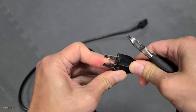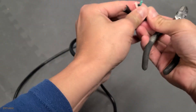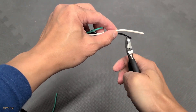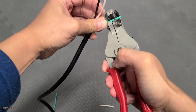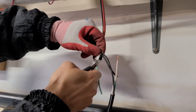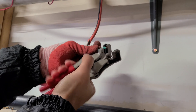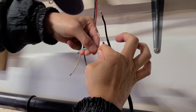Going back to the repair — because it's burned it doesn't smell good, so I'm going to cut it off. Next, we are going to get to the wires inside. This part is very important: you want to cut the wires in different lengths, roughly one inch apart. Strip the wires using your favorite tool. At this point we have the black wire being the longest, the green wire being the shortest, and the white wire with the length in between. Moving on to the other side, we do the opposite: make the black wire shortest, the green wire longest, and the white wire the same length in between. Next, slide the heat shrink tubing onto all the wires — you need to do this before soldering or you will be very screwed.